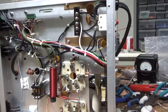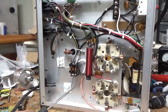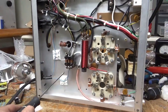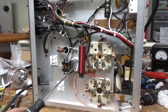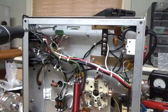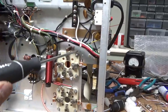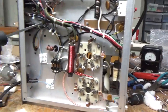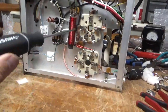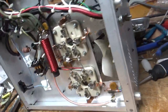Here's the bottom. Bias mod, secured the wires going to the TR relay. This has a stock standby/operate switch — don't want any stress on the relay coil connections, that's why I do that. Changed the electrolytic cap, changed the diode, touched up solder joints. Wired for 220, zip-tied everything. Fixed the wiring, grounded the grids. Changed the SO-239 connectors — they had like no grip whatsoever.